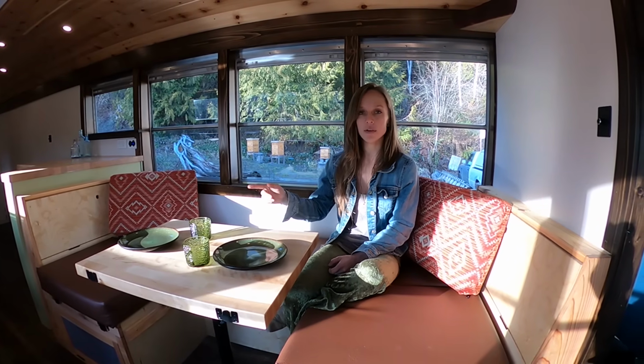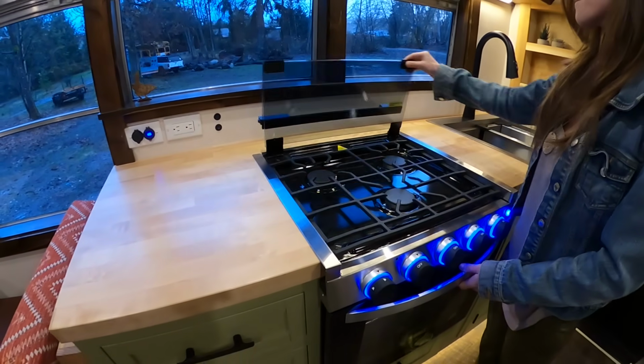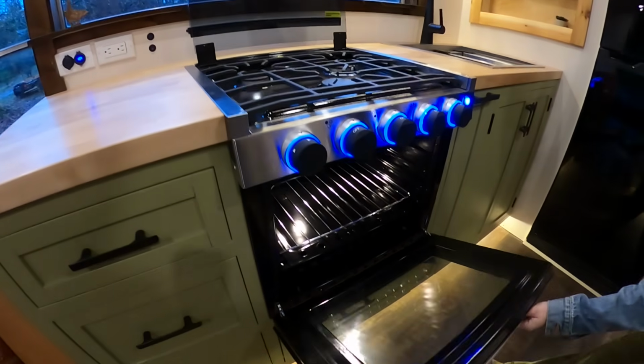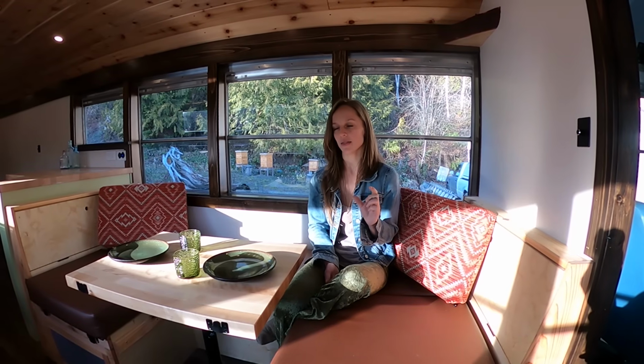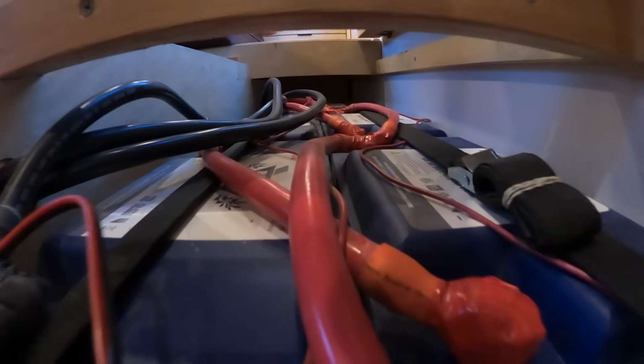It also powers the oven lighter ignition, so you can auto light your burners. We use a Webasto as our main off-grid heat source because it uses 12 volt power, which is super efficient. It barely takes any of that and just sits on your onboard diesel, which we tap off of the onboard, in this case, 100-gallon diesel tank. We ensure to keep it 4 inches off the bottom of the tank, and this means that you can only run that diesel heater until you're at a quarter tank. This is super important because if you're familiar with big rigs, if you run a bus out of fuel, it's a pain in the butt to get it primed again.